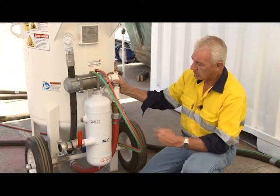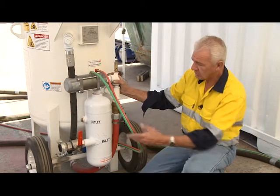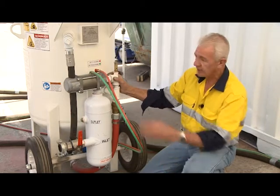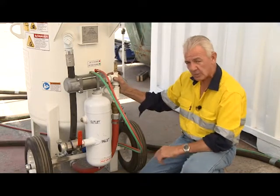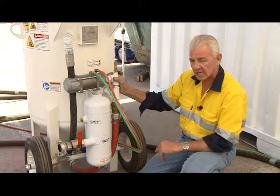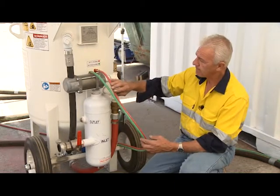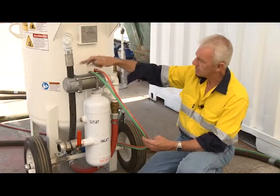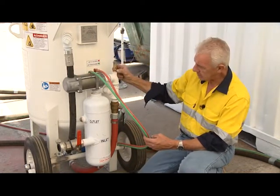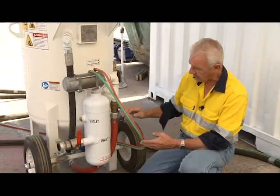With your pressure gauge you can check the pressure coming into the pot to make sure it's not exceeding the rated limit if you can't identify it appropriately on the compressor. All these checks are put in place to ensure we are safe throughout the entire blasting procedure. Remember to check this periodically, make sure it's clean, and remove it periodically without any air over this particular pressure vessel.